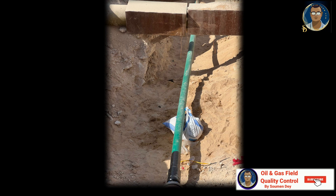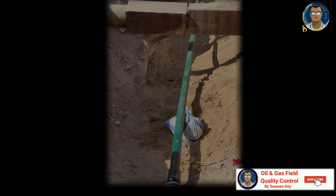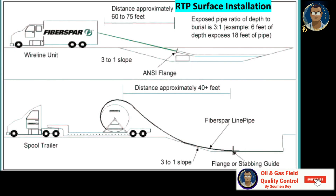For entrenched installation, road or river crossings are handled in a manner similar to pull-through installation. For surface installation, the techniques are similar to those of trench installation, but some special considerations should be given for pipe protection. Jacketed pipe will be used for surface installation for extra protection. The pipe should be installed and supported on smooth ground, not on pipe supports as used in the case of surface installation of steel pipes.